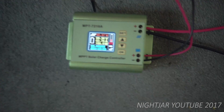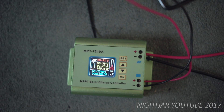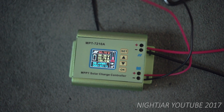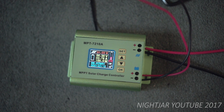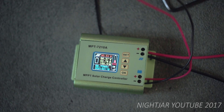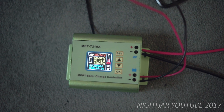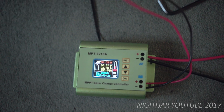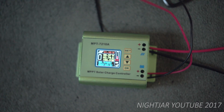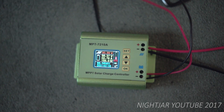As you can see, we're getting a decent amount of power. The panels are tilted towards the sun, so that's going to improve it a little bit. We're getting 155 watts, which I don't think is too bad at all — that's a good amount of power. I've been running it for 40 minutes but I've just been testing, so I've been having it turned on and turned off. We've managed to get nearly 60 watt hours. Now 60 watt hours on my bike is at least 6 kilometres, probably more like 8 or 10 kilometres, and that's just from 40 minutes of charging.